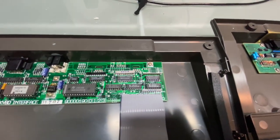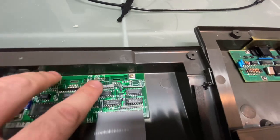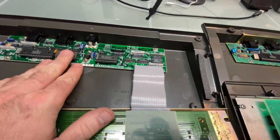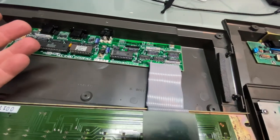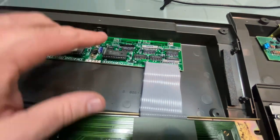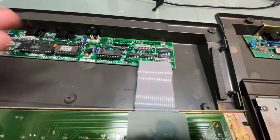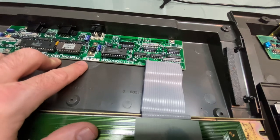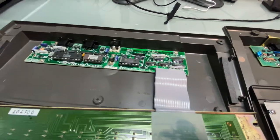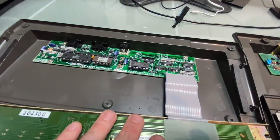So it's not going to be as simple as merely cutting holes in here and soldering 2 connectors. It looks as if you're going to have to actually add some additional hardware. I'm not sure if the ROM on here will support it, if they removed it. I don't know. I would think that they would remove it. And the only reason I think that is because they have all this open circuitry, so stuff could be floating. I don't know if they're holding anything low. If I/O is floating, then you're going to get a bunch of noise on the channel, right? You're going to get a bunch of characters from buttons that aren't being pressed, that physically aren't there. So I'd like to see somebody actually modify their newer NABU production keyboard and see if you can actually add these diodes and make it a 4-port.